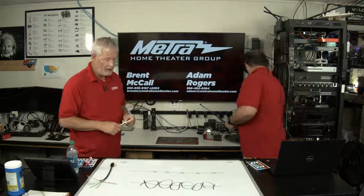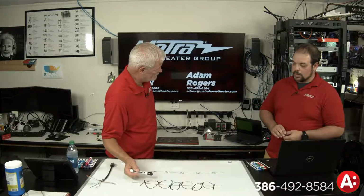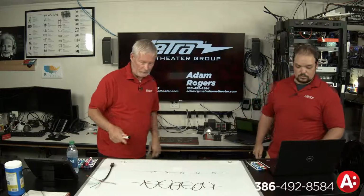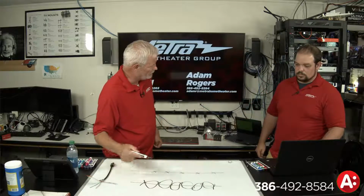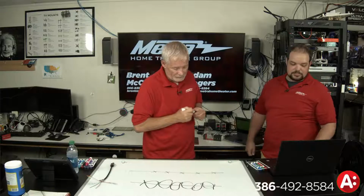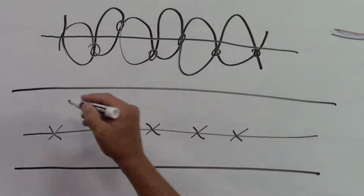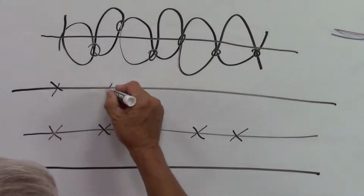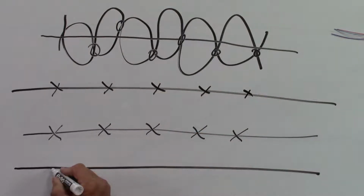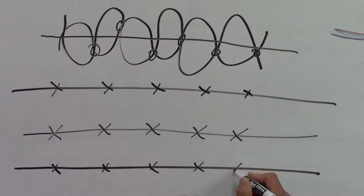Now, let's talk about this in greater detail because this is just a single one of the three conductors. One of the four actually, but we're going to focus on the current HDMI specifications and the 3 high-speed channels. So we've now got 3 of these like this, and you've got intra-pair skew issues there. Along with that, you also have to look at inter-pair skews. On those, the crossover points should not only be square on the center point, but with each other. So this is intra. This is inter. One cable is intra, multiple cables is inter.